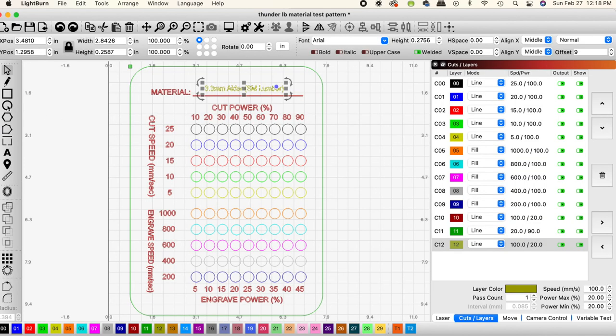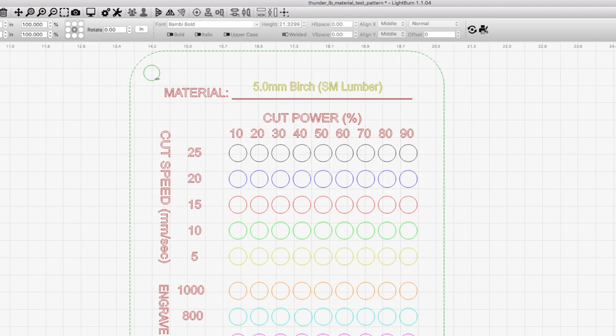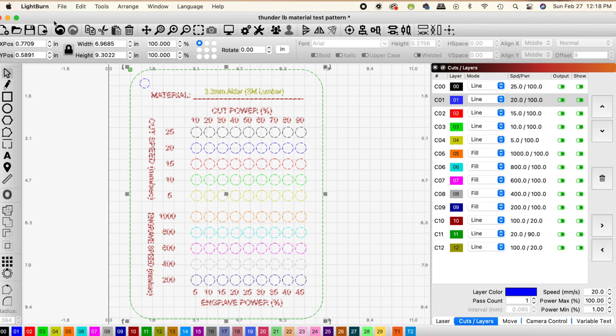A tiny extra step I like doing on all of our material cards is to cut a little hole in the corner so I can bind them together and keep them all in one place — I just love having everything organized and easy to find. To make the cutout, click the circle in the tool panel on the left, then click and drag to the size you want. Change to the arrow tool to move things around in Lightburn and place the circle where it looks best. I made sure the perimeter of the test card and this circle cutout were the same color so the settings would be the same and they'd cut out properly. I used a speed of 20 and a power of 50 — safe values for a cut on this type of wood. With the text changes done, group everything back together by going to Arrange and then Group.